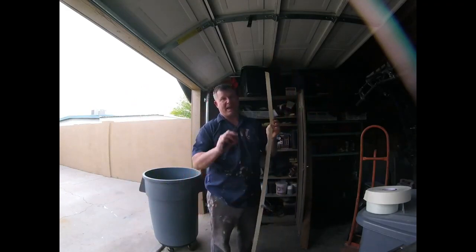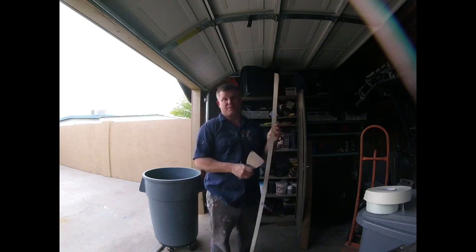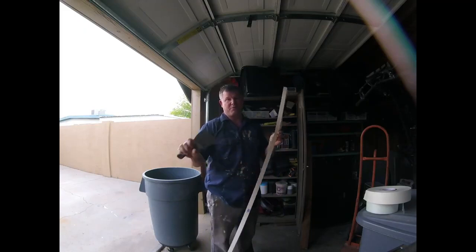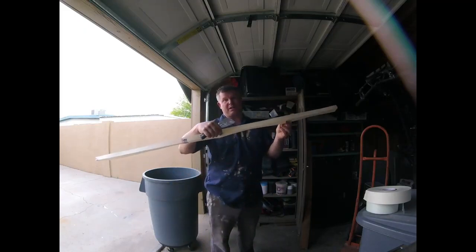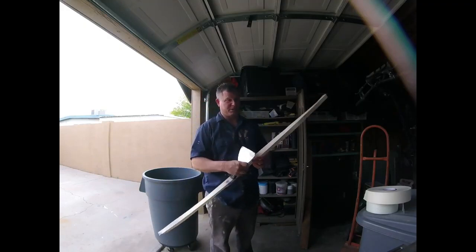Maybe if it's a big gap in the drywall, maybe someone hung the sheetrock themselves and they're just hiring me to come fill in gaps or whatever. I usually do a pre-fill in big gaps, and if they're really bad, we might even do a layer of paper tape and let it set overnight so it really bonds and secures.